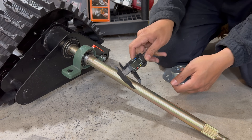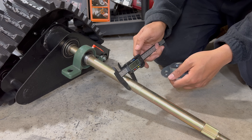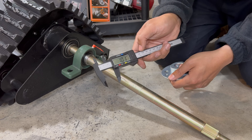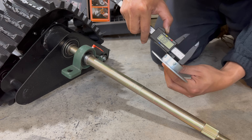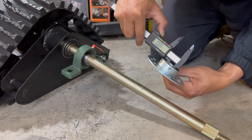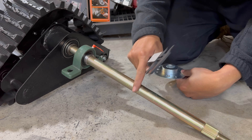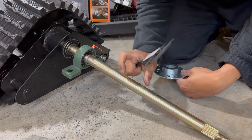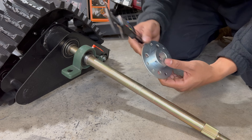The strangest thing is the axle measures out at 1.01 inches, and the inner diameter of the adapter shows exactly one inch — it's just a hair off. I'm going to grind this down ever so slightly in this section just so we can slide it in. It'll be good if it fits super snug anyway.